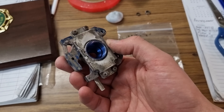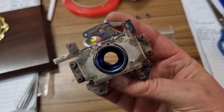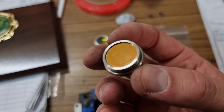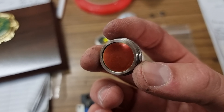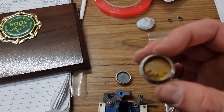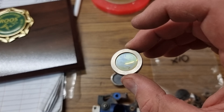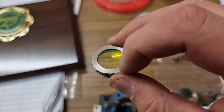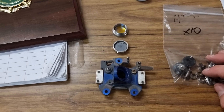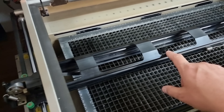When you're cutting acrylic in a laser it does create significant fill-up, so air assist is definitely useful on the lenses and the primary mirrors — you do need to keep them clean. If you're doing metallic stuff it will reflect back on the mirror and put little gouges in it, and your collimators will tend to suffer as a result. Doing highly reflective stuff is not great. You can see a little mark on the edge of that mirror, and these ones have got a bit of residue on them, so we'll give everything a clean-up while we're waiting for bits to arrive.